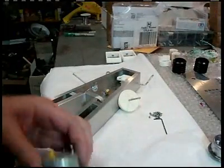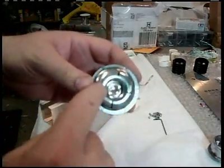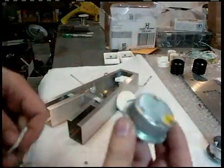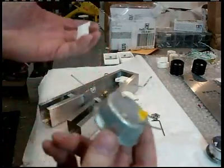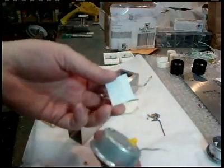There is a piece of prep work that's done to the horn. I'll cut these slots in it here to let the sound out. The outside of the case of the horn is one of its connections, and this wire is its other. So we have to isolate this horn from the metal case, otherwise it would be beeping all the time. So we'll probably take a little scrap of plastic. It won't be anything special.